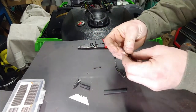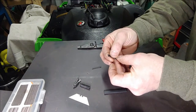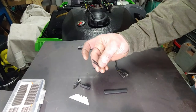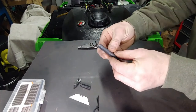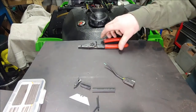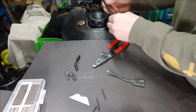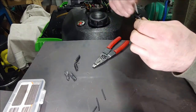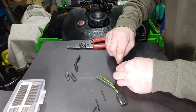What I'm going to do is solder the ends first - get everything cleaned up, put solder on them individually, then you can put them together, heat them back up, and they just stick together. The heat shrink pieces will get slipped on over the wires and then heat shrunk on. This big piece right here is going to get slipped on before everything and go over the entire group of wires. Let's get started - clip off all the old junk.